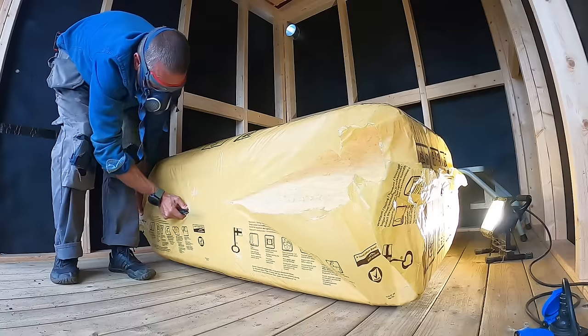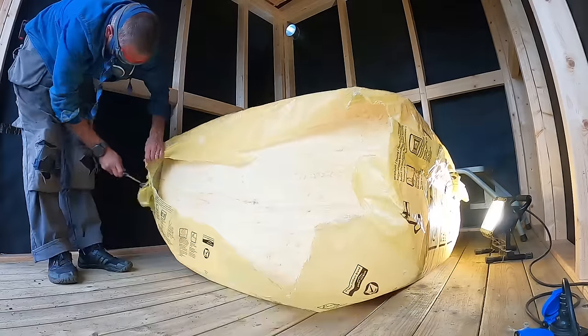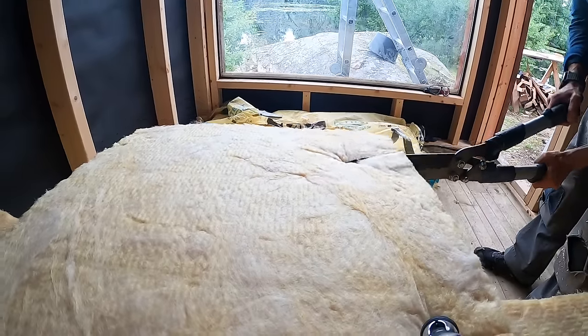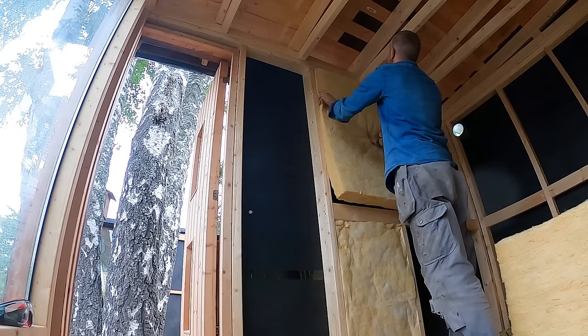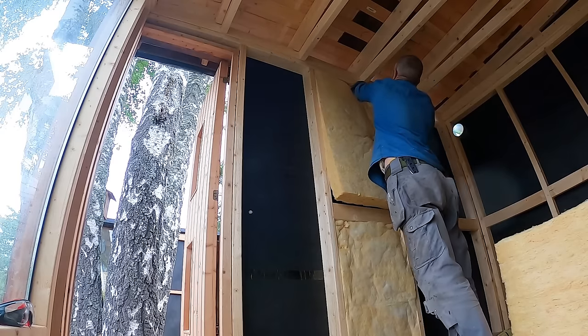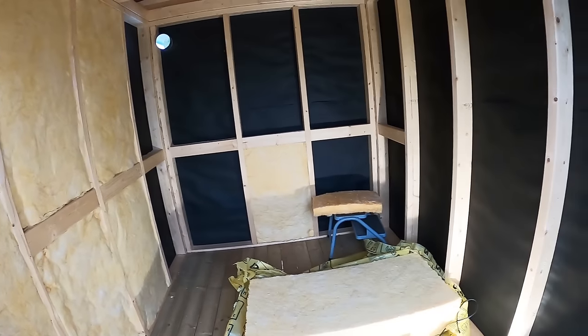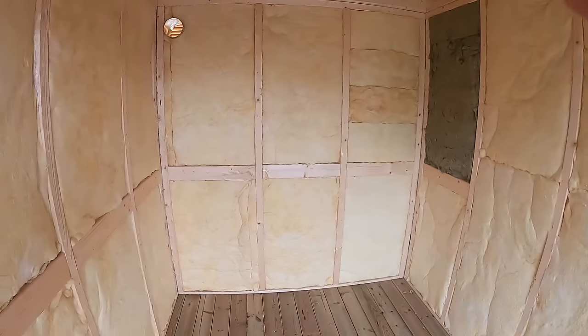Finnish sauna insulation rules say that you should have at least 10 cm insulation in walls and minimum 10 in the roof. My sauna does 100 degrees Celsius when it's minus 20 outside, if I wanted to. This alone says that it's well built and insulated. Later on, I give details about calculating the size of the sauna oven.